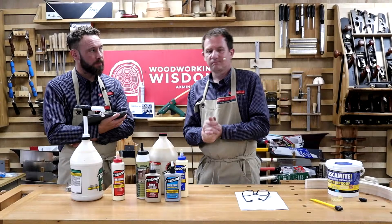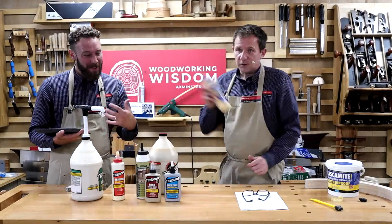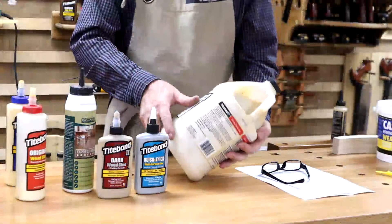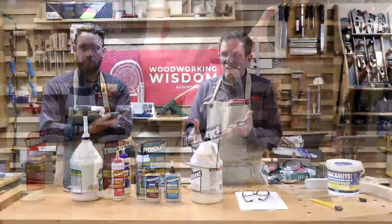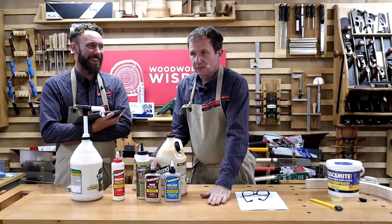One thing I never knew: you need to shake the glue bottle before using it. PVA separates out — the heavy particles sink to the bottom and the water rises to the top. You can see the colour change near the top of the bottle. If it's been sitting on a warehouse shelf, it will have separated. Mix it again by shaking it well before applying. You might actually get stronger glue at the bottom of the bottle.